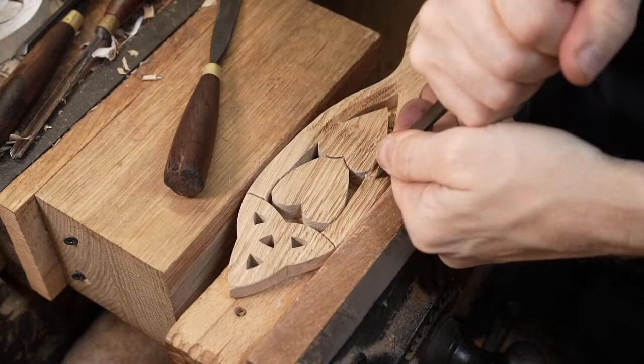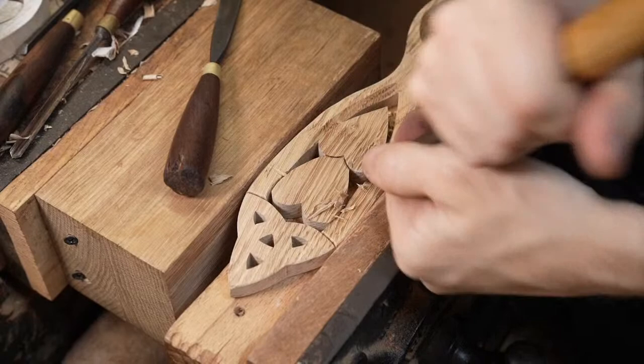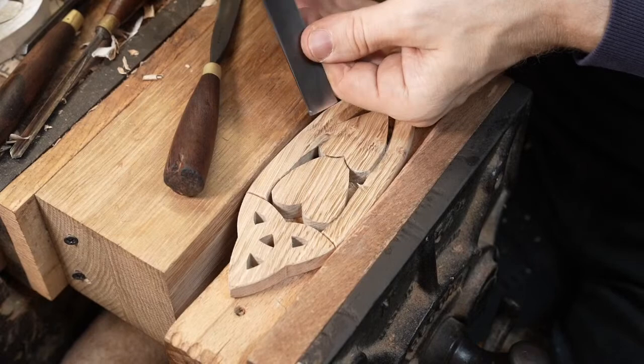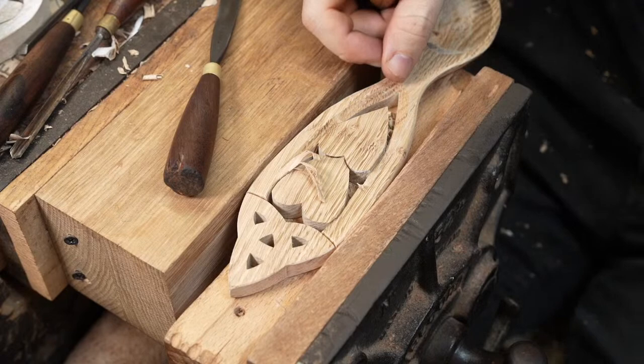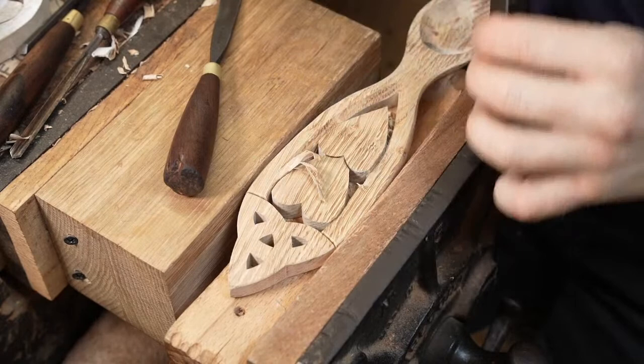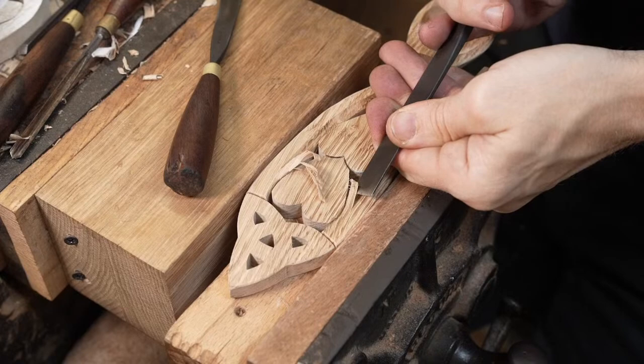See, so is that what you're referring to with tear out, where you can see that's tearing? So basically, as that starts to tear in that way, yeah, you'll notice with me, I tend not to worry about it. This side will be fine, because the nature of that grain is going slightly off at an angle. Right, brilliant. Glad it's an example. We can show you what we do. So that's starting to tear. The simple reason for it is because the grain is starting to pull. It's the direction of that grain. There you go, see? So that wants to pull up in a big splinter.